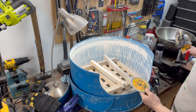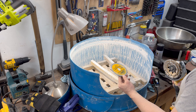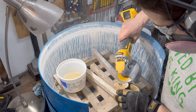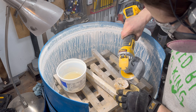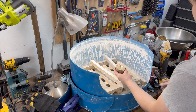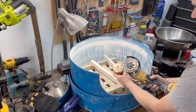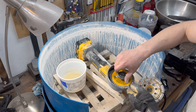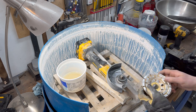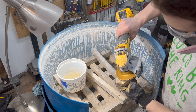So, you'll notice there are two blades that I use. This first cutting blade cuts really fast and it can be used to flatten rocks — so if there's a high spot, I can drag it across and kind of nibble away at some high spots. Once the rock is reasonably flat, I use this masonry bit, which is used for flattening and will give it a uniform flat surface. It cuts slower, but still quite a bit faster than what we're going to use next.